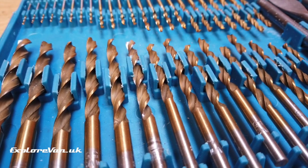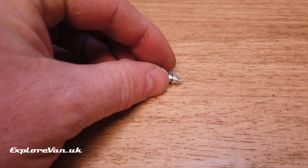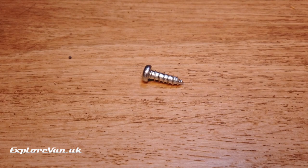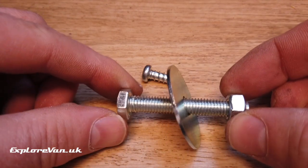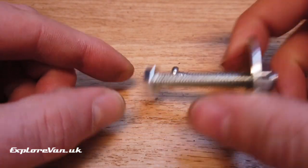For each hole Milenko suggests a 5mm pilot hole, but then they use self-tapping screws to mount the brackets. This enables the brackets to be fitted without access to the back of the panel, but it wouldn't take much to pull these out. So as I can pretty easily access the back of the panel, I want to replace the self-tappers with nuts, bolts and a large washer to make them even more secure.